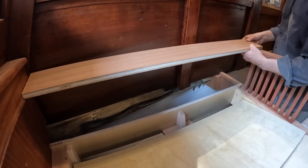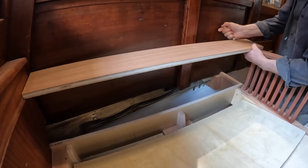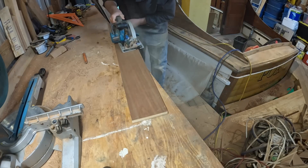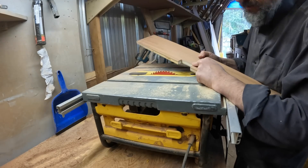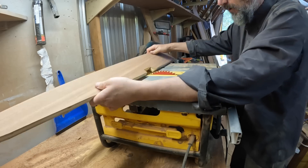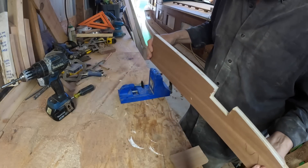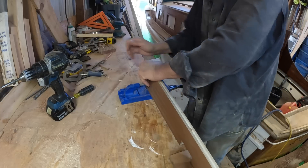I'm going to do this in a series of scribes — relatively crude at first, and then the same amount all the way up from there. Once you've roughed out a cut like this, work from the back side so the blade cuts into the good work without making a mess of it. These are fitting really nicely now. I'm going to put a bunch of Kreg pocket holes in it because this is going to be attached with pocket screws.